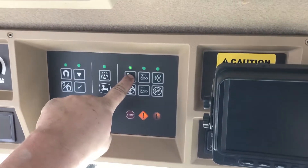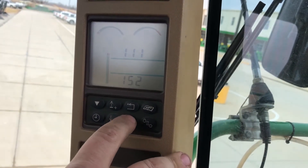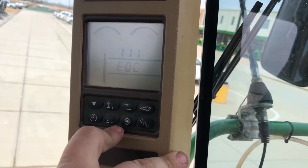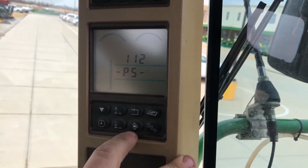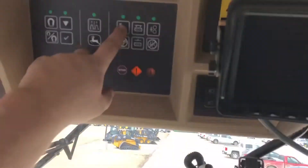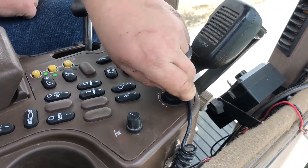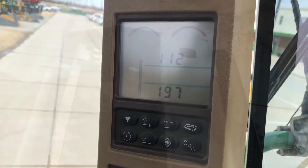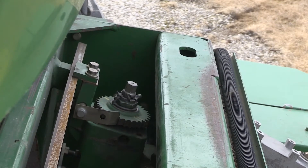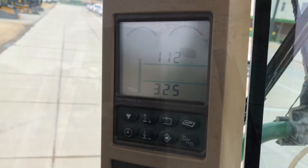Address 111 is the park position, far to the left. If it was in the park position, then we'll go to address 112. Hit enter, power saver. Now we want the stone half on the knives and half off the knives on the left-hand side. He's moving it to that position. Whenever you get it where you want it, hit store — end of calibration.